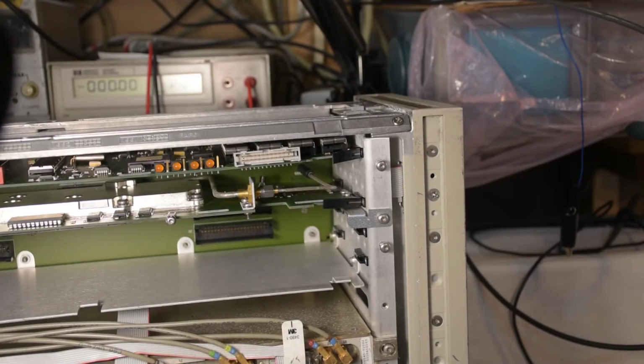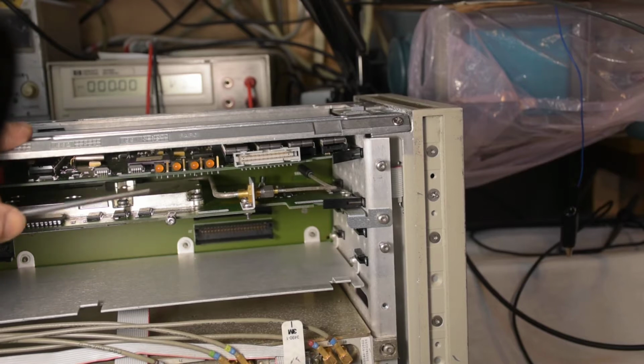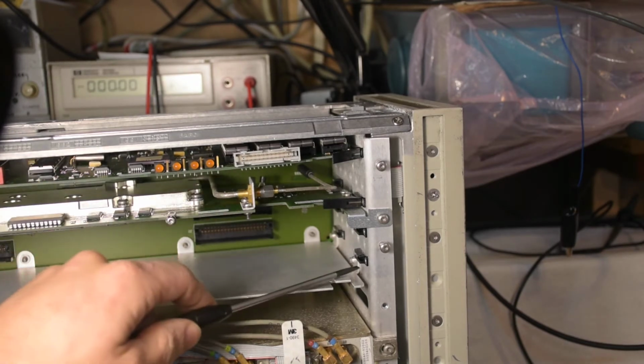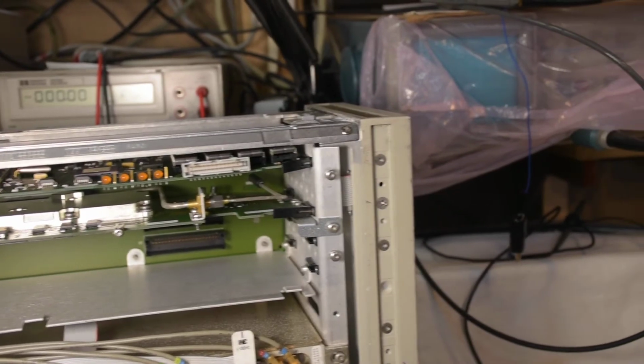Well, I found something. A crime was committed. I was going to remove the DCU board, the first one on top, just to get the ROM chips dumped while I'm waiting for capacitors. And I noticed it was jammed in there pretty good, and the DCU board isn't quite in those little plastic rails like here. And the second one, that's the attenuator board. That's even worse. Check it.